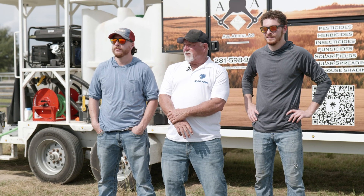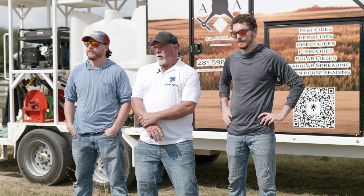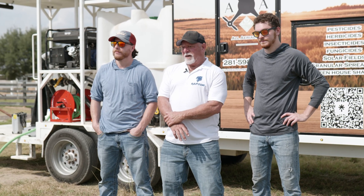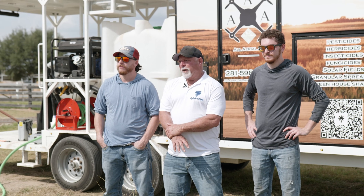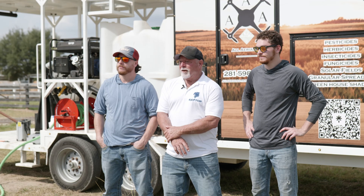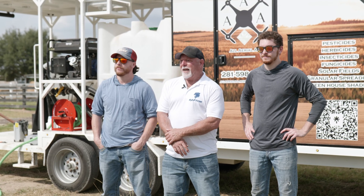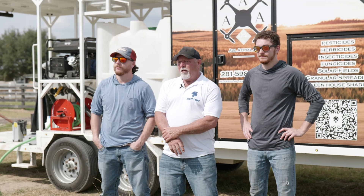Okay folks, we've had a successful day killing weeds and getting ready for next spring. It should have some very pretty pasture grass out here. The day went really well. I want to just emphasize a little bit about cleanup and maintaining your gear. One thing we've noticed with our experience is the cleaner we keep stuff, the better off we are. Check your battery contacts — make sure you don't have any connections arcing from dirt. Keep your drone very clean; it'll save you a lot of headaches, maintenance, and repairs over the long run.